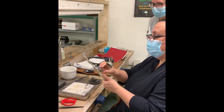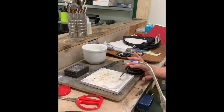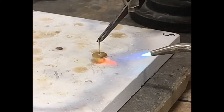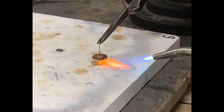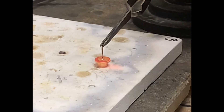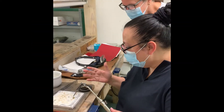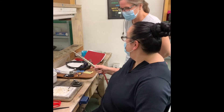We're using a little double zero tip. My finger is just gonna rest on the third arm, and you'll see my flame is on the piece, not on the post. Ta-da! That's what you're looking for — it flowed, zero cleanup — all the things that we want.